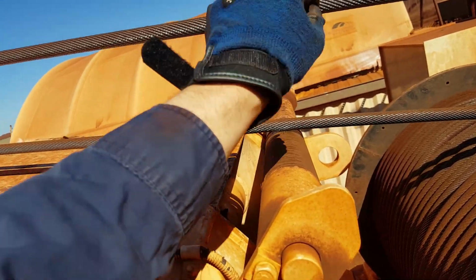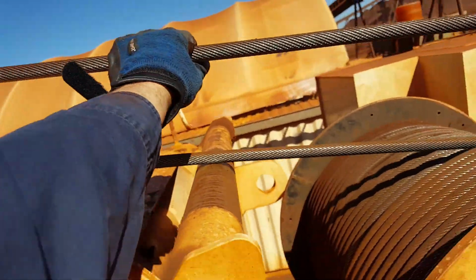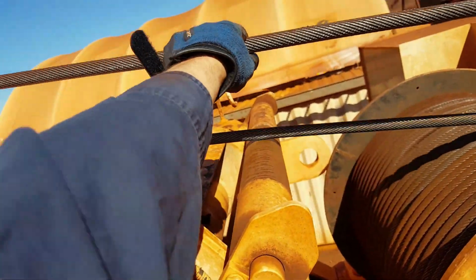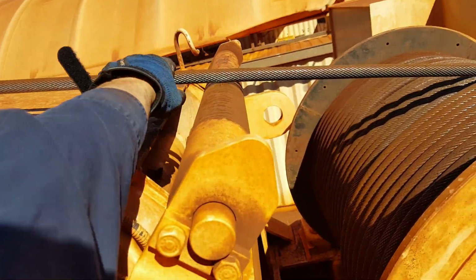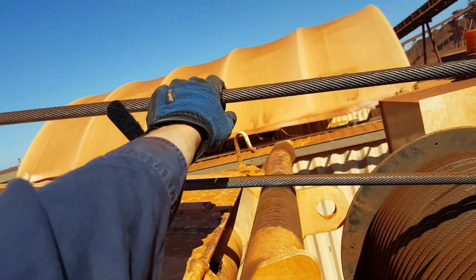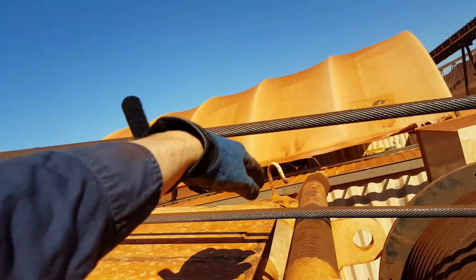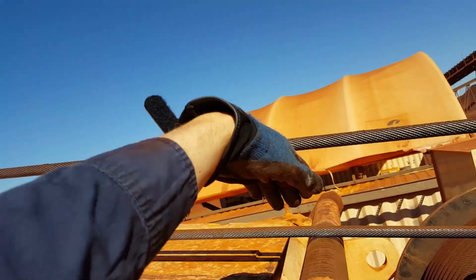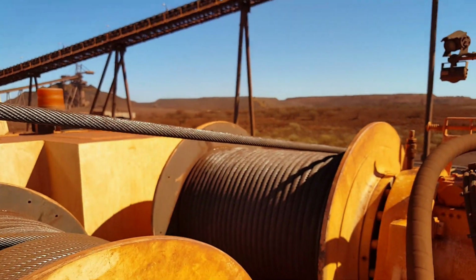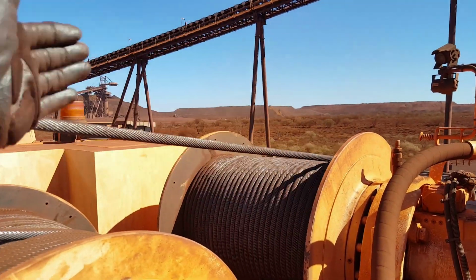Alright? We're starting to understand the science. 4 parts of line. Look, I look like the ultimate warrior, smashing the ropes. Alright, 1 part of line, stuff all. So if this one goes up to 6 parts of line or 8 parts of line, imagine how sloppy this would be. It would be all over the shop. Imagine this winch here, when it's winching, it's going to have a hard time laying it on the rope.